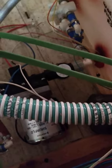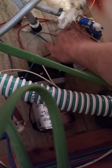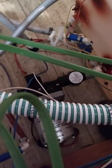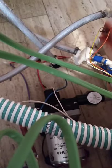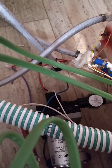There are valves here for your tank. You'll use this water pump to draw the antifreeze in. This line — you'll take the cap off and put it into a gallon of antifreeze. You'll make sure this valve is open and the valve going to your tank is closed, just the opposite of the way it is right now. When the pump is running, it'll pull antifreeze through this line from the antifreeze bottle and pump it throughout the system. Right now it's set up to draw from the water tanks for normal camping, but if you're going to winterize, you'll just switch the valves — basically reverse them. You have to bypass the water heater when winterizing.